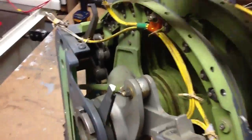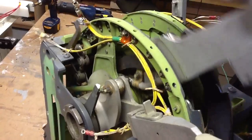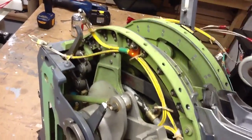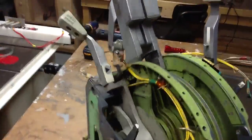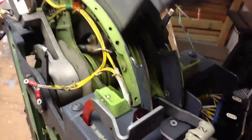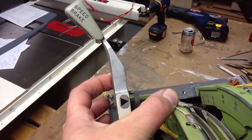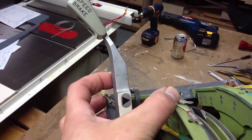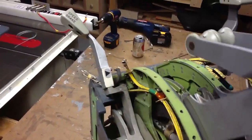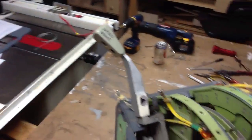There's a whole mechanism down in here. When you pull the throttle in a certain position, it creates a mechanical stop, so that arm pivots up or down. When the spoiler arm is all the way in this position, you'll see that arm goes up. There's a little tab on the backside so it can't be pulled back. Then when you push it forward again, it gets to a certain point and then pops out of the way, and you can pull back. It's all mechanical.